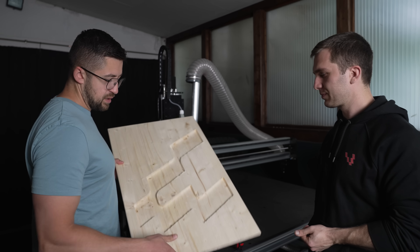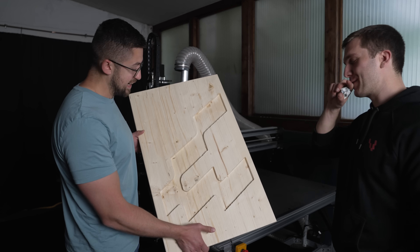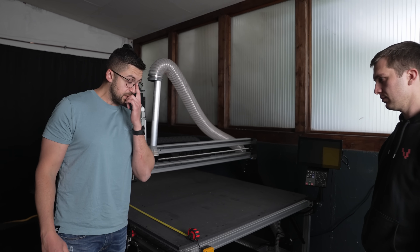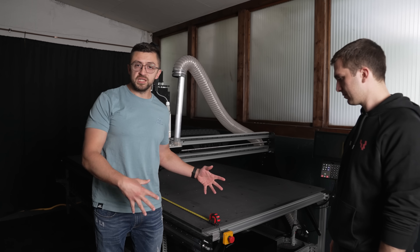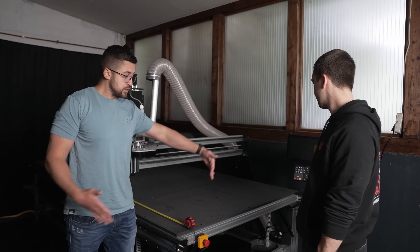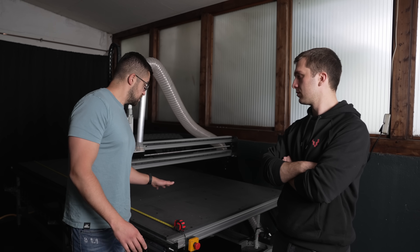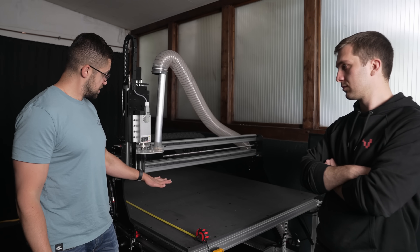The machine is installed. We bought some very quick low-quality wood for a test — I keep saying test print but it's a test cut. Obviously for proper wood cutting like for splitters we'll be using proper wood — this is just to see if it works, and it works. The machine is almost 3 meters long but the working space is up to 2.7 meters long and 1.3 meters wide. The intention is not only mold creation but also doing flat floors — most of the time flat floors are done in multiple sections anyway.